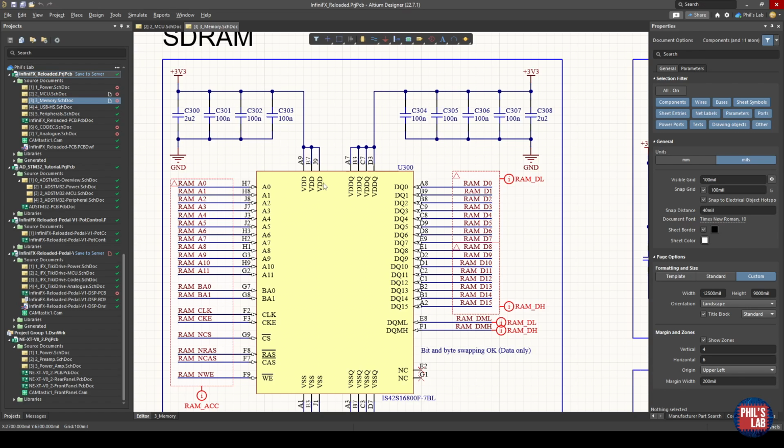I have VDD as my internal voltage, and per VDD pin I provide 100 nanofarads of local decoupling, as well as for the whole VDD bank, so to speak, I provide 2.2 microfarads as my bulk decoupling capacitor, and we'll see later how these will be placed. I also have VDD-Q pins, which are my output driver voltages, which supply my output drivers.